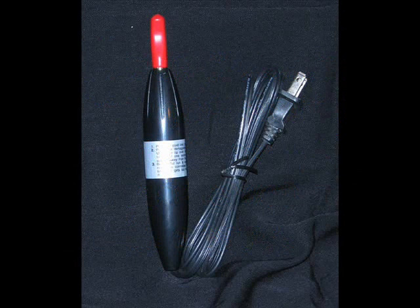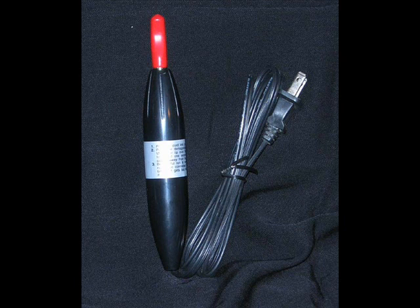Now let's talk about demagnetizing. Finding a good demagnetizer is a little bit difficult these days. Sometimes they pop up used on eBay, but I found one from an electronics supply house for less than $10. And it's a pretty good one too. This one is powerful enough to do all kinds of tape recorders plus video recorders.